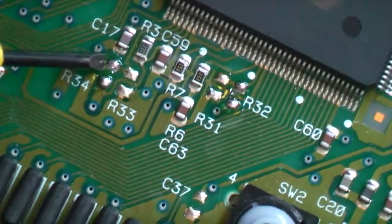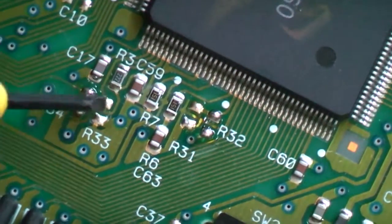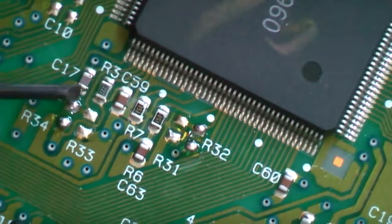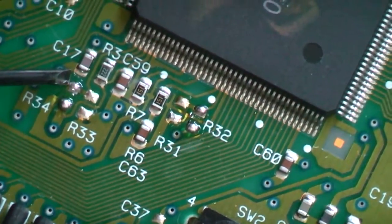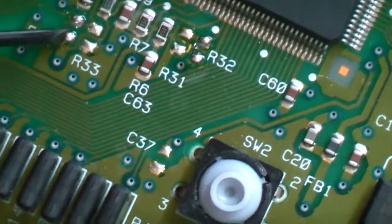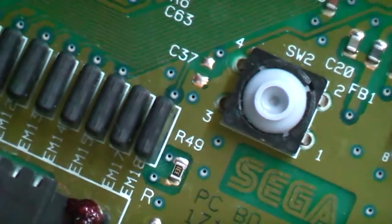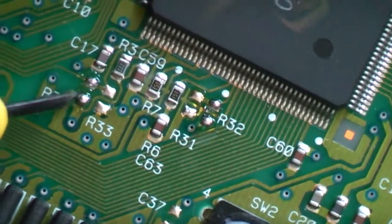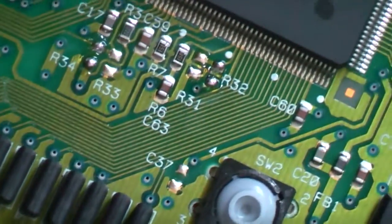When you're looking at the 50/60 hertz one, which we'll do first, you can see that these two contacts at the top are joined together and it follows up this path into the Sega 315 chip. That's where we're going to add our wire — in this case we're going to use a white wire and it's going to go to the centre of our switch. And then down the bottom we've got our five volts and ground. Mount your switches up first before you do any of this — it's always a lot easier. Then basically we'll tap on the wires and we're home and hosed.